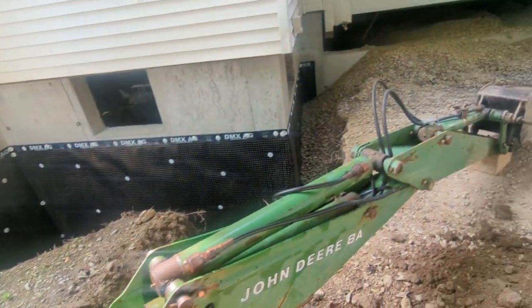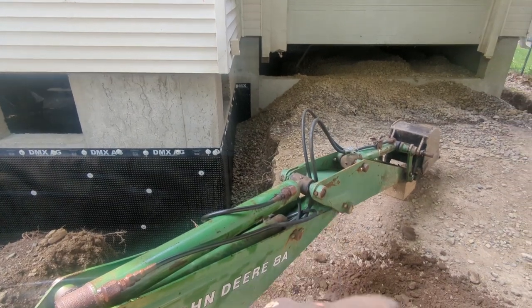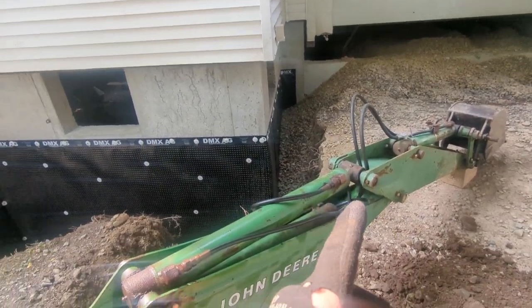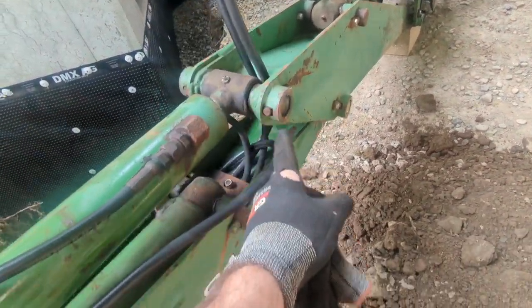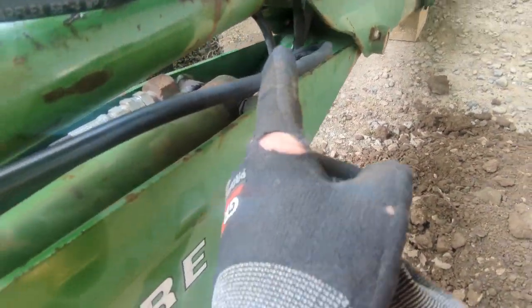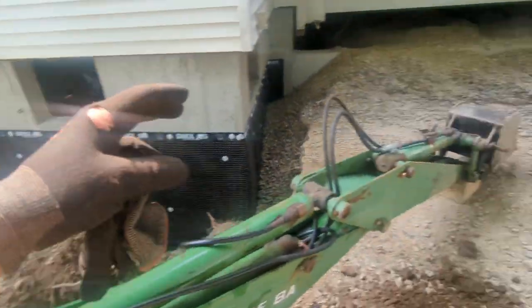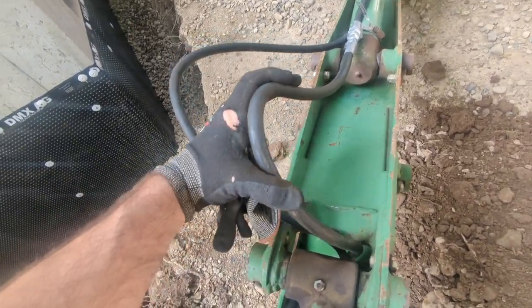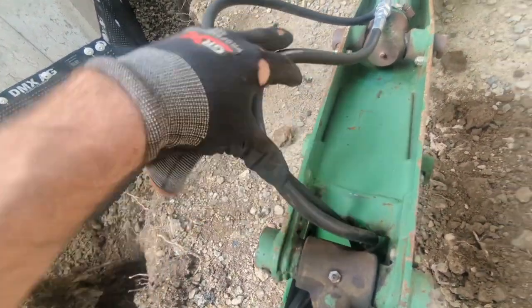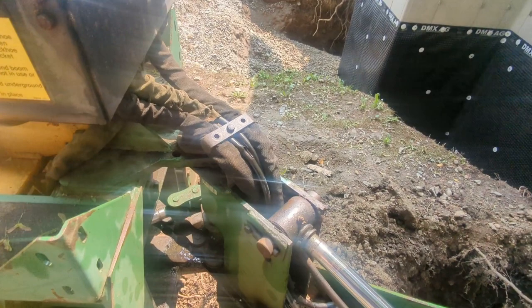The thing about a backhoe you want to be careful of is that you've got to have enough slack that you can articulate it, but not too much that you can accidentally get, like these loops can actually choke through there and end up in there behind the cylinder and down in there and get pinched. Because the thing is, you can gather a turn like this so hard that it's jammed because it's rubbery, and then, you know, this can close and you can crack or bust it open, where this, that's not what happened here because this bend is protected from that sort of thing.